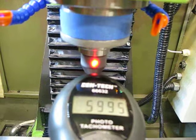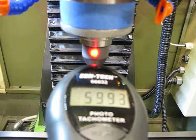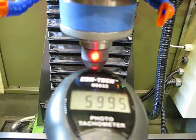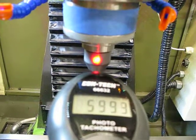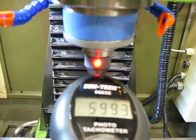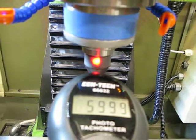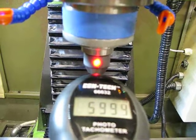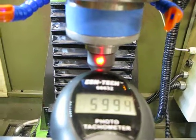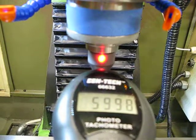Phil gave me the option to switch to the 1 to 1 pulley ratio or leave it at 1.5. I'm going to keep it at 1.5 because with the modified spindle - the better bearings, grease, and all - I don't think temperature will be a problem for the spindle. It may be a problem for the motor, but I lose a little torque at the top speed. Since I'm mostly working 6061 aluminum, that should be okay.